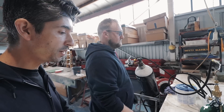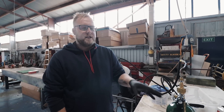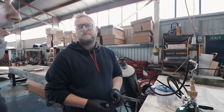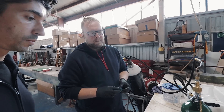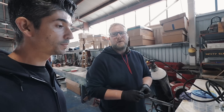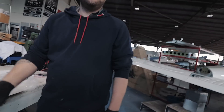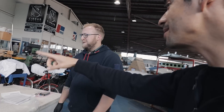So we're not just going to open it up and fill it in one big hit. The general rule is about 200 psi per minute. If we fill it too quickly, the oxygen actually expands and heats the bottle up — that's what we're trying to avoid. From about empty, where we are today on a new bottle, it should take about 20 minutes to get it full. That's about as exciting as it gets — this is the point where we wait. We can do a time lapse.